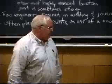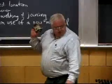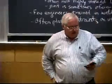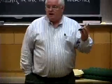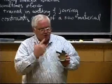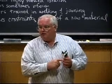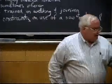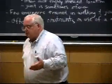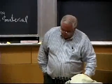Plus or minus. Okay. This is a stator. One of these is from a 747, one's from a 757 engine. I can't remember which. But in any case, this is a stator vane. This one's got the same cooling passages. This one doesn't rotate, it's stationary, but it's got the ceramic coating on it. And the joining of that ceramic coating is important. And again, the ceramic coating is there because the gases going past this thing are hotter than the melting temperature of the metal that's in it.